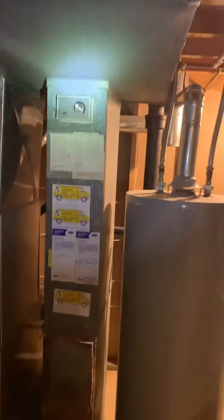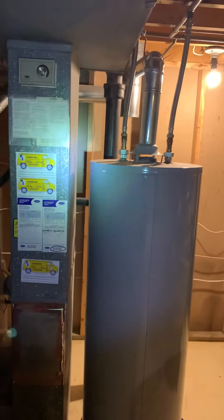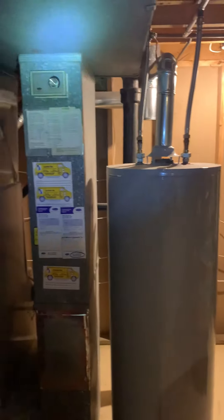For better airflow on the entire system. The return is 9x22 — it's really undersized. We have the spacing for our 5-inch filter and we have the room to increase this to probably 11 or 12. So I'll talk to them a little closer about that.